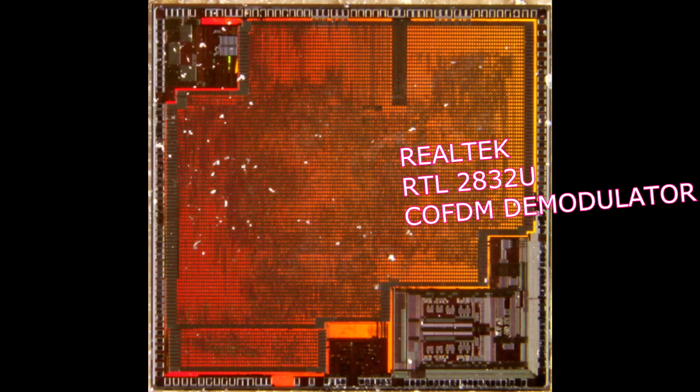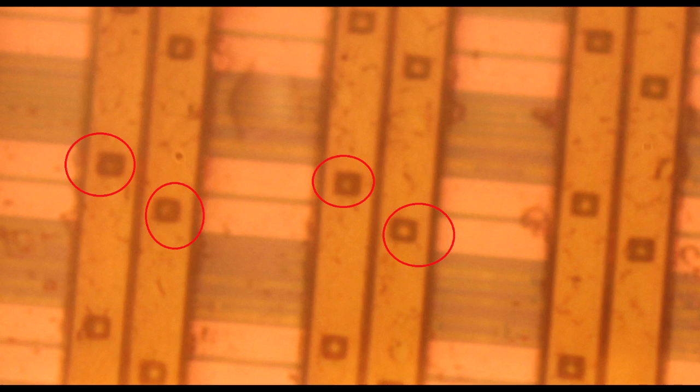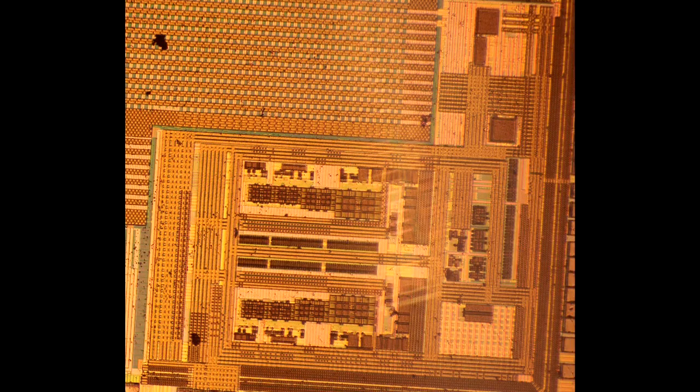This is the second chip and this is the one where there's so much work going on right now. This is the RTL2832U from Realtek — it's a coded orthogonal frequency division multiplexing decoder. It takes IF on one side and spits out to USB on the other side, which is being exploited by all sorts of programs out there. If you take a look at the center, the colorful portion is basically heavy metalization. Zooming in, this pattern looks like vertical and horizontal lines — basically a power distribution network. There are two of them, and I would presume one is power and one is ground, with those little circles being interconnects between two metal layers. On the upper left and lower right are some functions without that metalization — I presume those are more analog in nature.